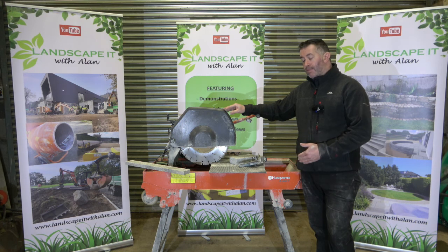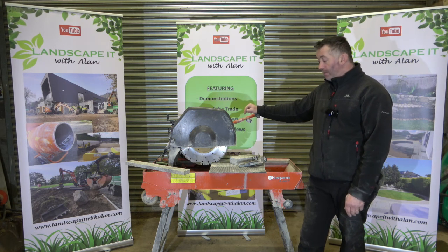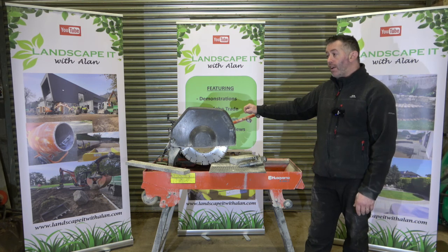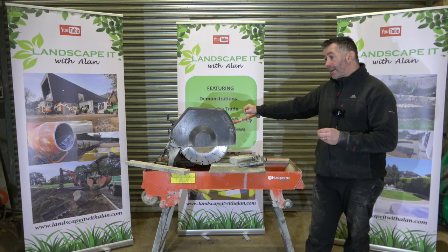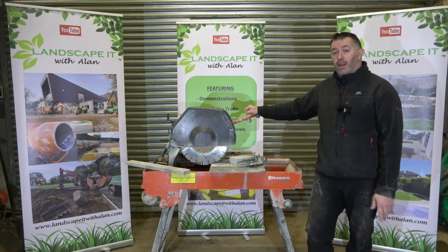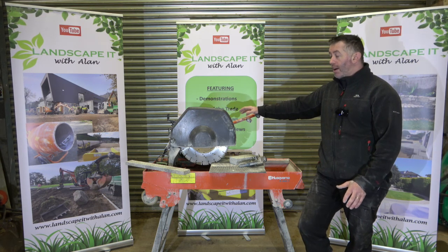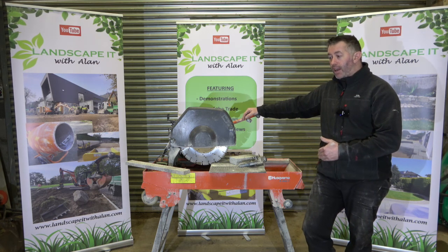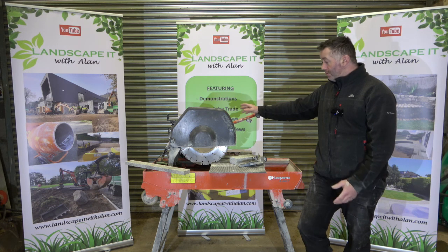If you put the wrong blade on, you're going to think this machine is useless. If you put the right blade on, different animal altogether. By us putting this blade on — we did get a blade supplied with the machine, and it did do some quality cutting, but it had a very short lifespan. It wore itself out very, very quickly and just became unusable with a lot of diamond left on it. When this was supplied to me, it was advised we'd buy the proper blade. We were doing a lot of 4-inch solid block cutting, so we used the lesser quality blade. But when we put this blade on, it transformed this machine no end. The power was extracted from the motor much better — the quality it cut, the speed it cut. People weren't getting annoyed and frustrated standing behind this machine with the motor bogging down all the time. It was just power all the time and a joy to use this machine afterwards.